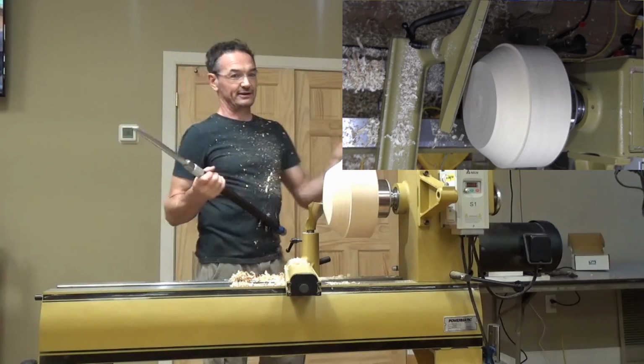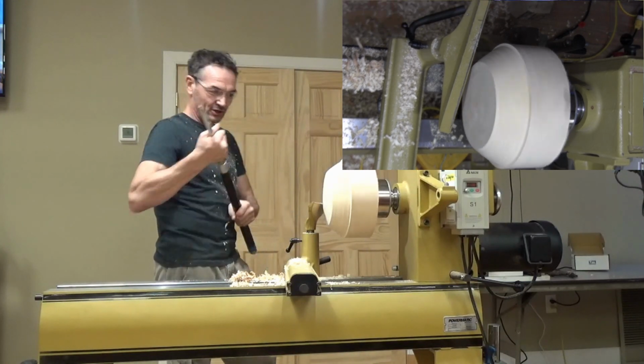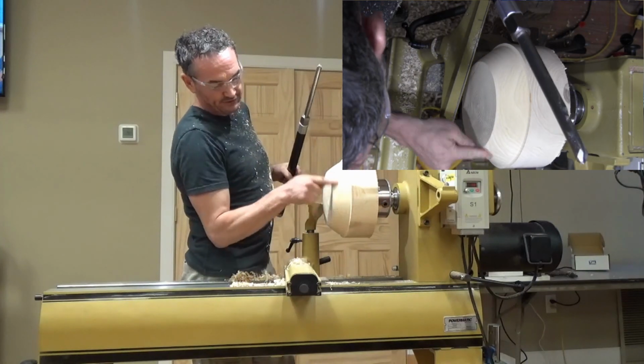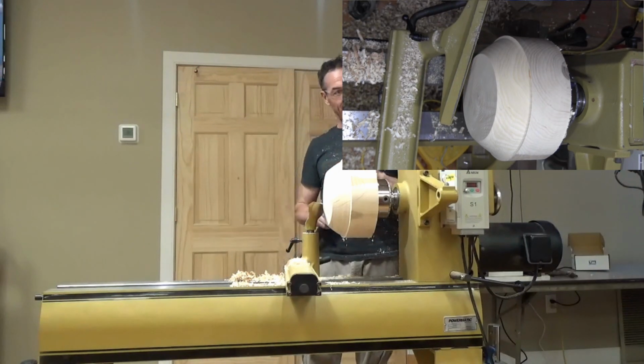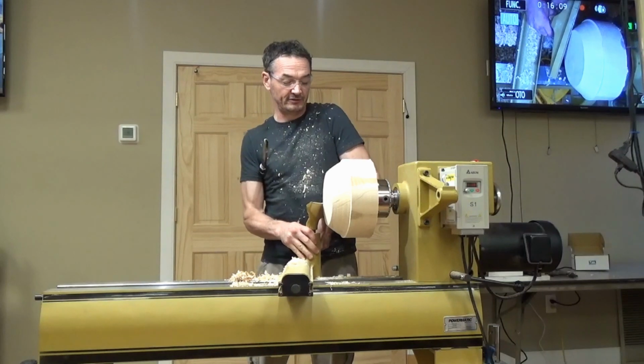So that was a left-handed cut, and I'm holding the handle with my left and using both hands, and I'm getting a really poor finish here. So torn out and damaged, and I'm getting ridges. And then I'd spend time fixing it. And I'm not going to do that. All I'm going to do is go directly to finish cuts.